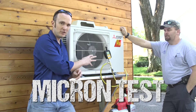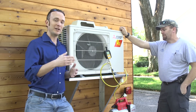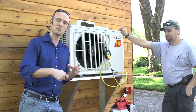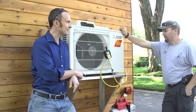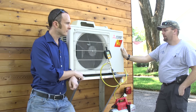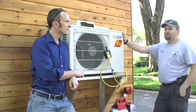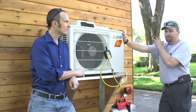This gauge is a vacuum gauge. The main problem — and the reason I put a gaugeless test in my book, Home Performance Diagnostics — is that the system is designed to be a sealed system, and as soon as you break into it with a set of gauges, the balance changes. Are we even testing the Freon right now? No. All we're doing is pulling a vacuum. The outside condenser comes with a pre-charge from the factory — it's already got the Freon, blocked off at valves where you make your connections. Once you achieve your vacuum, we're only pulling moisture out from the back of the unit up to the head unit. The Freon won't be touched until after the micron test, when we just open it and allow it to go back into the system.